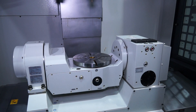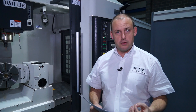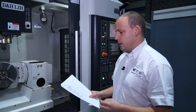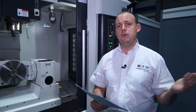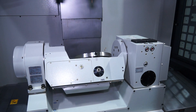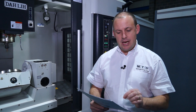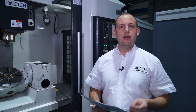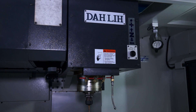The standard accessories that come with the machine include spindle-mounted coolant nozzles for coolant flow, fully enclosed guarding — which we can see on the machine — an RS-232 interface for communication purposes, every necessary item for coolant equipment, leveling pads, tools, etc. The machine also features Turcite B on the guideway, reassuring you that you're getting a heavy-duty, solid machining centre.